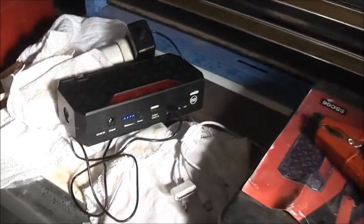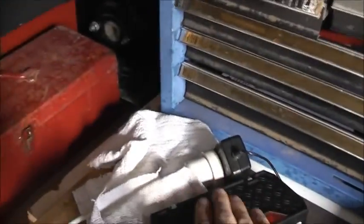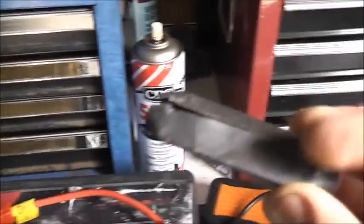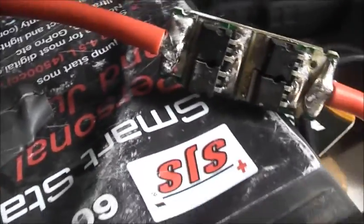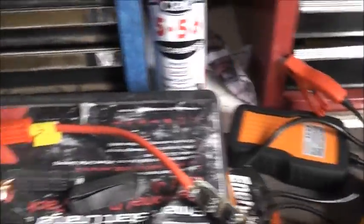I'll open this up and show you what's inside. It's one of those electric RC skateboard, plane, and electric scooter battery types — not the 18650 type sandwich cell where you've got three together. You don't want to damage those batteries, I tell you — those things are intense. Luckily this unit is okay, there's nothing wrong inside. But I cut this heat shrink off and there's four big 40-amp Schottky diodes. Multimeter checks and confirming with a load — no output, so these are blown.